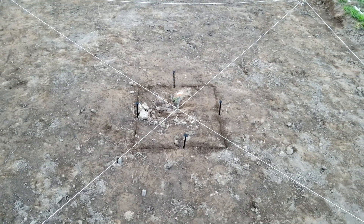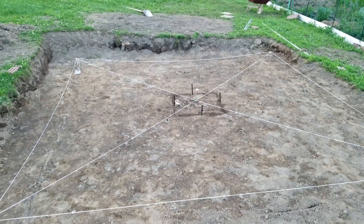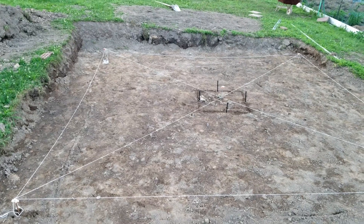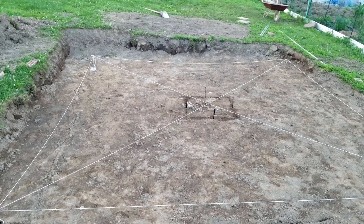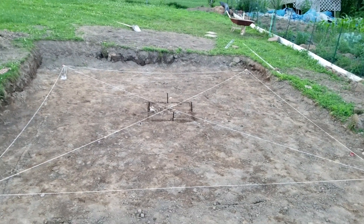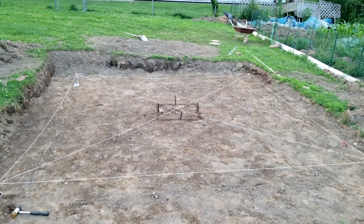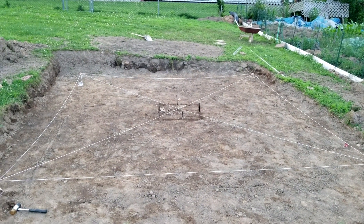As we can see here, that is a two-foot by two-foot square that has to be dug down four feet past the frost line and up to about 14 inches above the ground to the deck surface. From there up will be the pier portion — a 12-inch sonotube or PVC pipe going up about 43 inches above the deck.